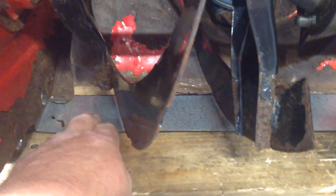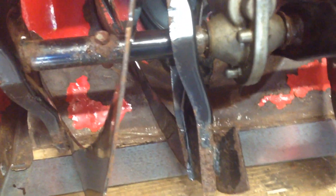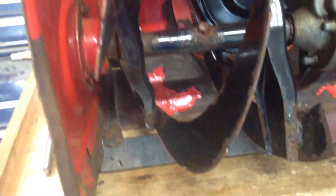Been working on this damage under here. I got a new set of skid shoes on it — universal ones. And I made this like temporary cutter bar for it, but it's actually pretty solid so I might just leave it. I made it out of that thick sheet metal I usually make side tins and stuff out of. I wanted to take another piece of that and wrap it around and bolt it all together, put a little strip in there with bolts. And maybe some JB Weld just to make sure it's tight, cause I don't know if I can technically weld this stuff — it's pretty thin. I think I'll just clean it up, JB Weld, bolts and nuts, and we'll call it good.